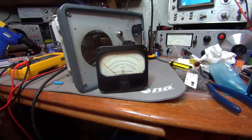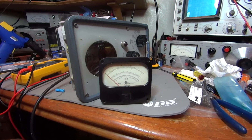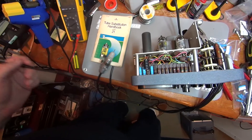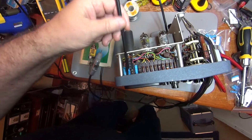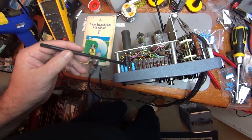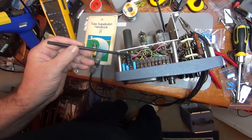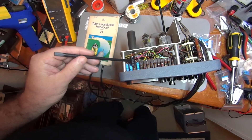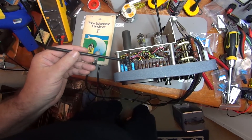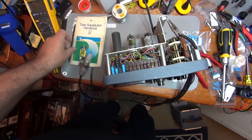The meter glass and meter are cleaned up about as well as we can. Tobacco is really hard to get off those white meter faces but it's plenty readable. We replaced some power supply resistors here and also the power supply filter capacitor. This capacitor has a standoff on it — never put one capacitor over another. We used the ground on this one but put a standoff on the positive. It's calibrated up and doing pretty good.